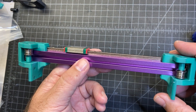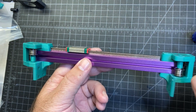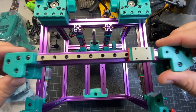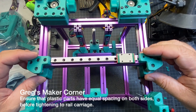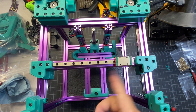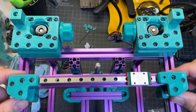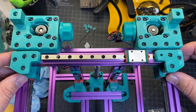It's a good time to check your work. You want these bearings up here and these bearings down here, with this piece here and here in that orientation. You can also check the side view - that should be on the bottom on this one and on the top on this one. At this point we're going to set in the X-axis. You may have to adjust these a little so that the plastic parts touch the rails. You're going to be screwing in four M2 by sixes into these little holes that line up right with the carriages on the rails. They are a little loose and that's intentional. We also need to install the end stop piece, and I'm going to push it all the way back and then tighten it as well - that's how you square it. If it's a little off, it's not going to print well.